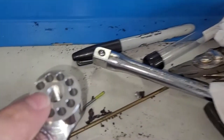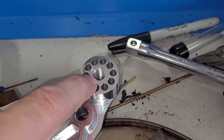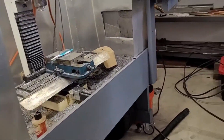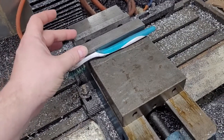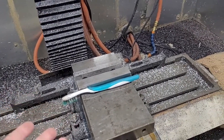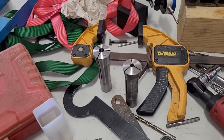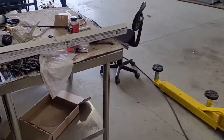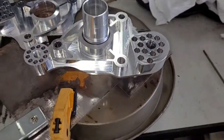It's basically ready to go. The only thing we had to address was this hole — it was drilled quarter-inch when manufactured. I didn't want the other company to do the threads; I wanted to do it myself, so I had them do a quarter-inch hole. It's actually an M10 by 1.25. What I did was grab a quarter-inch collet, put a quarter-inch drill bit in, clamped the bracket in here, and used the drill bit to find the center of that hole — the quarter-inch bit fits perfectly. Then I retracted, swapped to the proper tap drill size, 8.7 millimeter, drilled it to tap drill size, and tapped the hole. That turned out great. I did a test fit with the pulley — it goes right in and bolts up. This side works because it's just a hole; the bolt threads into the block.